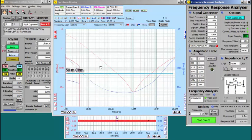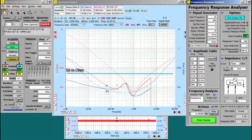Now we can see immediately that the impedance of the board at low frequencies is now quite a lot lower. It's around 348 milliohms, whereas it was about 6 ohms before. We can also see that we've got a composite impedance plot with the superposition of both of the responses of those capacitors. The ESR is now also much lower, starting at around 25 milliohms at 1 kilohertz and much flatter.